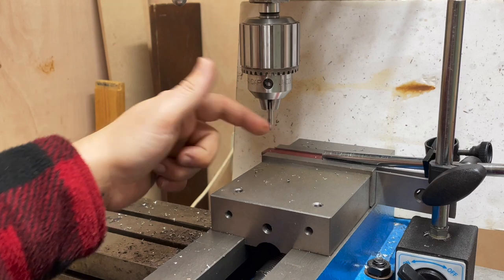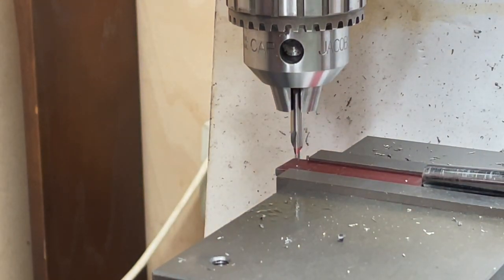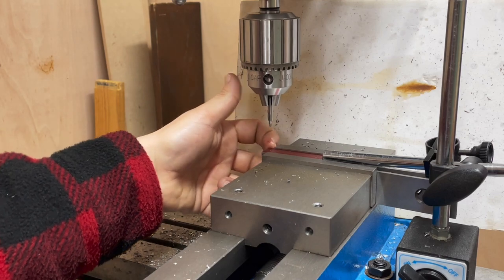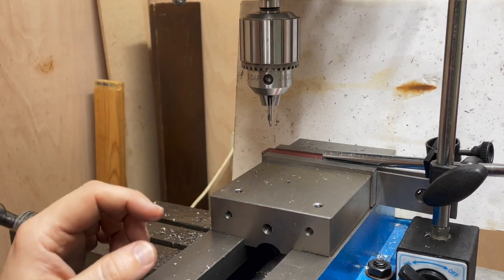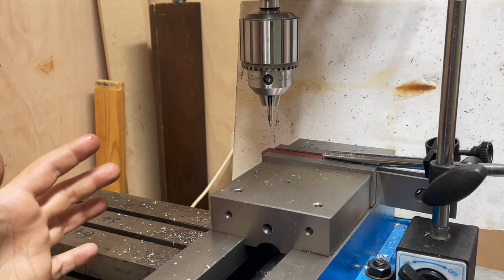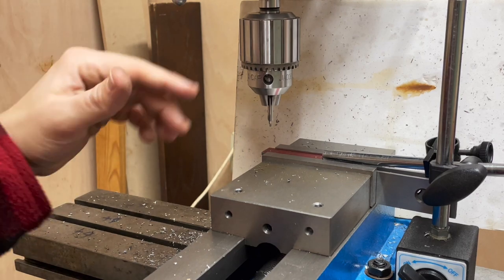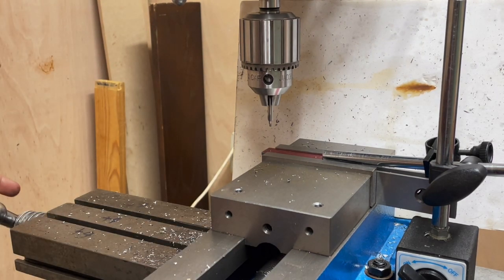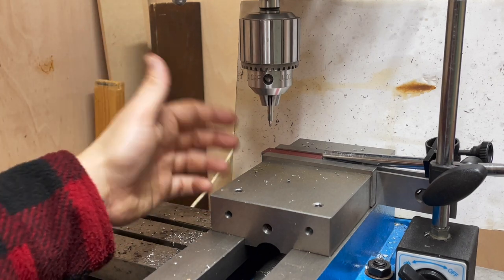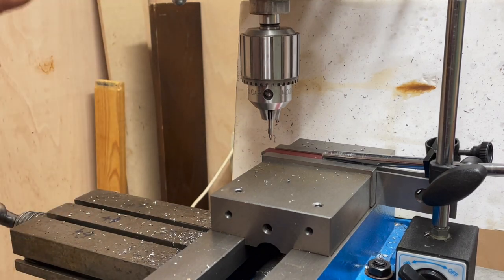I have the stop here and the piece here — this is what I use to mill the edges, as you saw. And now, if I bring this down — I appreciate it's probably quite hard to see — it's bang on where it needs to be. I use that with edge finders: we have a disc finder here and a larger edge finder here, and I've dialed it in. If there's any interest in me showing how I'm dialing in these parts, please let me know, because when I got into machining, it seemed that everyone had a DRO and would simply get the edge, zero the DRO, and move across to exactly where the hole needs to be. When you're using a manual machine with no DRO, you need to account for backlash and do certain order of operations. So if there's any interest, I'm very happy to do a short video on that. Anyway, I'm now going to do a bunch of drilling — I'll time-lapse you over there — and hopefully at the end of this we should have the horn stay fixing holes done.